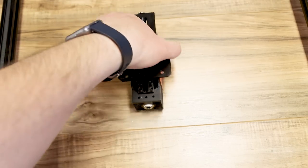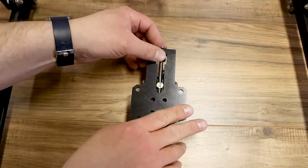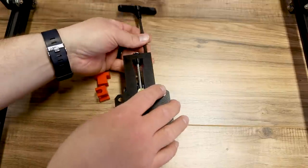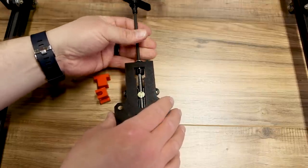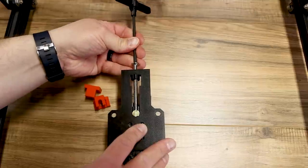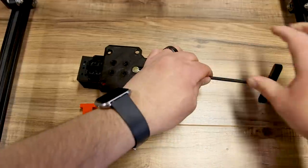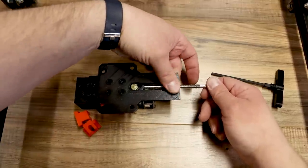As I was working on this I realized that when I lowered it, a piece came loose. They told me this was a weak point in the design and sent me files to print to fix it, but we have to take it apart first. So loosen the T-handle all the way out and take the screw out of the nut. Going forward, they'll have this fixed so you won't have this little piece that fails. Now that it's loose, unscrew the printed part and take that piece out.